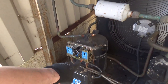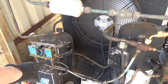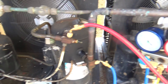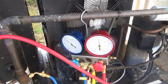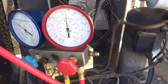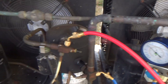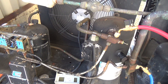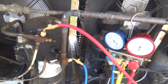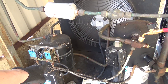You don't want to be poking these to make them run unless you know what pressure's in there. I put my gauges on something once and it went right past — these class 1 gauges went right past the top, round past zero. Especially the three-phase things, they'll pump up to stupid pressures if something's gone wrong or somebody's overcharged it. They completely filled the high side with liquid.